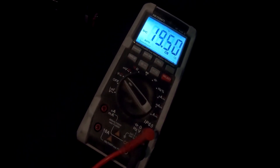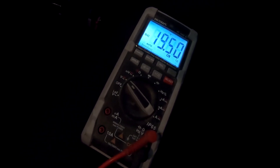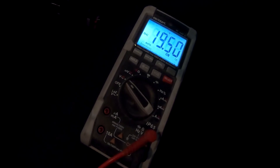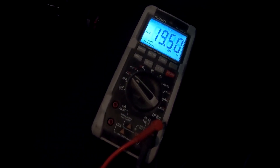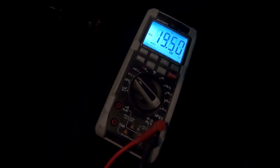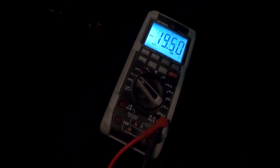I'm now in my car. Let's see what happens when I plug it in here. The voltage is exactly 19.5V. So it actually doesn't matter if there are small changes in the voltage going into the step-up converter — which is even better, because on boats and maybe if your car battery is weak the input voltage can change, but we have a constant output voltage. I just went to the car, checked it, and it works as well with the cigarette plug.